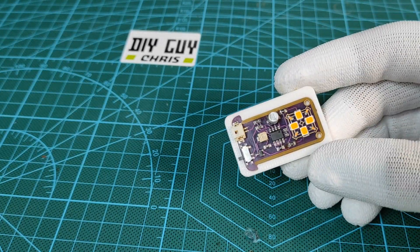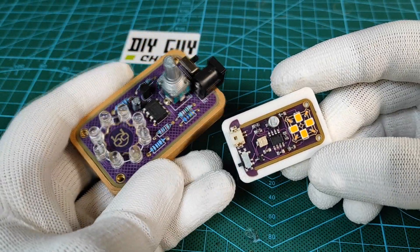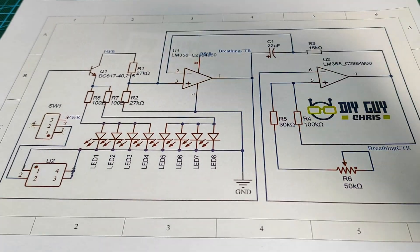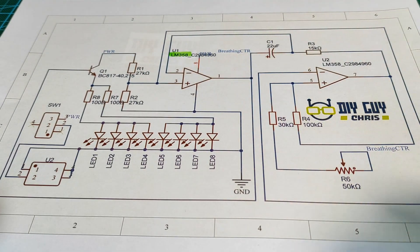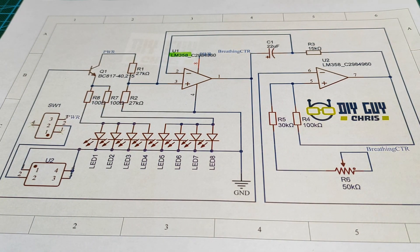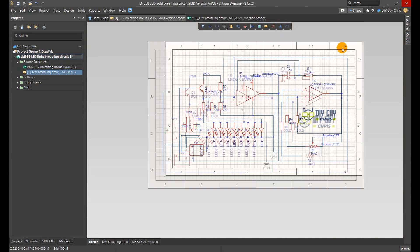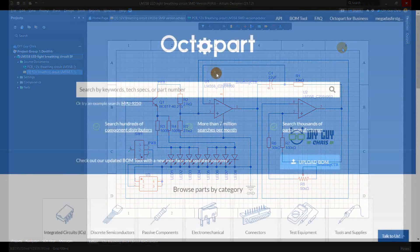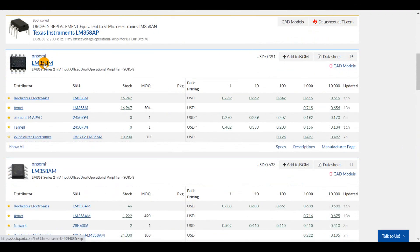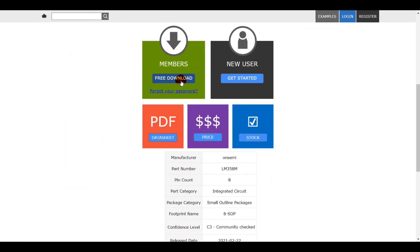As I mentioned in the intro, this is the small version of the previous through-hole based gadget, and both are using the same circuit schematic since they are both based on the LM358 operational amplifier. If you need to get to the details of this schematic, do not miss my previous video. The only difference is that we are using surface mounted parts here. You can search for the appropriate components from Octopart — I searched for the SMD parts I need, then easily downloaded and uploaded them to my Altium schematic.